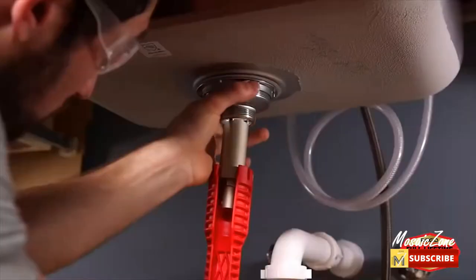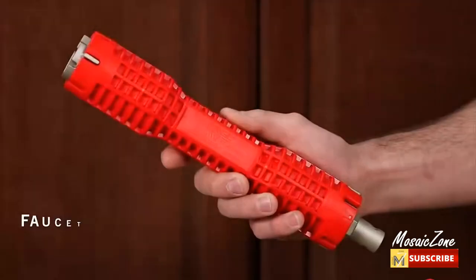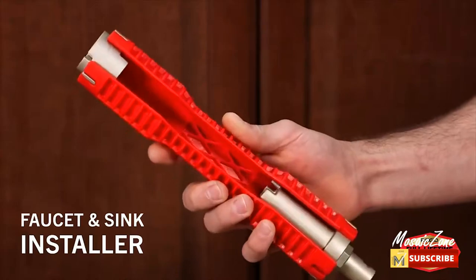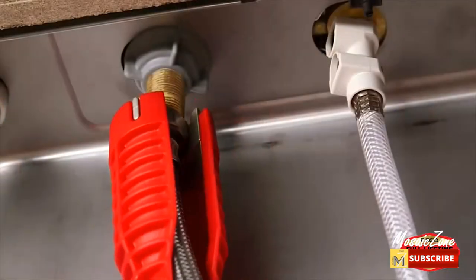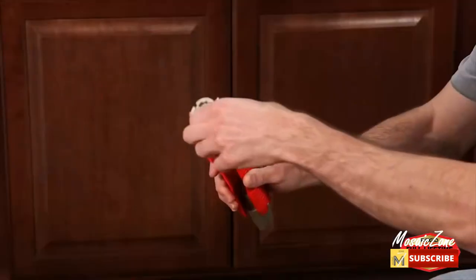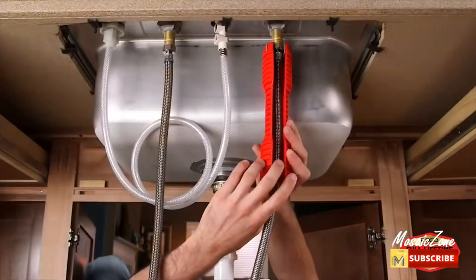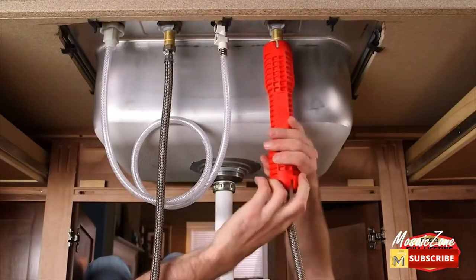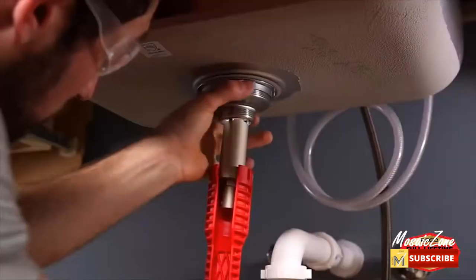Cylindrical insert features a 5⅛-inch deep-well socket for single-hole mountings, 3- and 4-slot strainer basket retainer, and hole-fit screwdrivers for extra leverage when breaking stubborn nuts loose. Multi-purpose handle — the notched end accommodates most common 2, 3, 4, and 6-tab basin mounting nuts, while the handle's open slot clears supply lines to loosen or attach. Compact and durable — handheld size clears tight spaces under sinks, while its reinforced plastic body and lightweight aluminum inserts provide long-lasting durability.